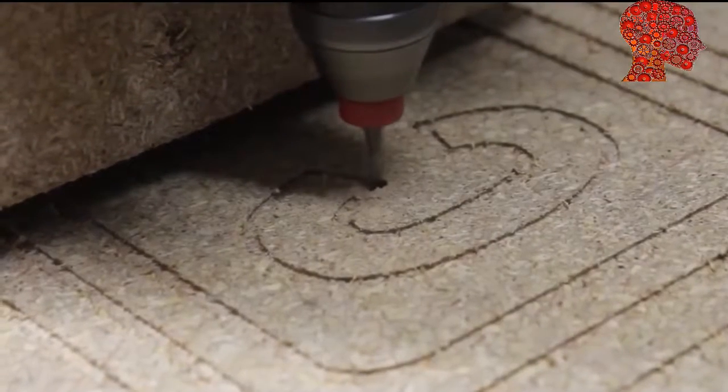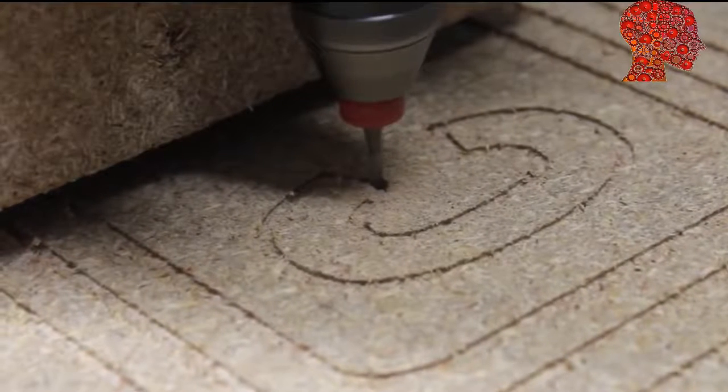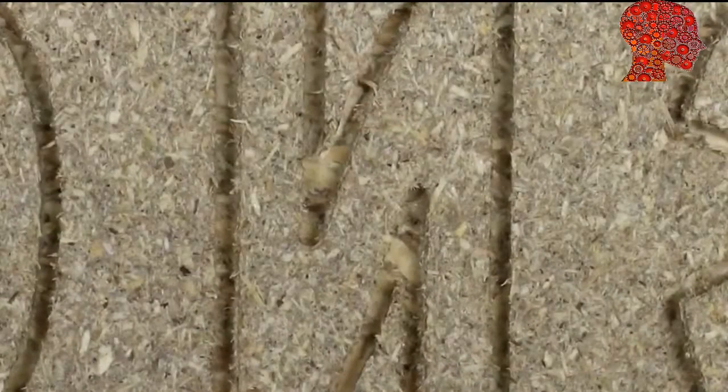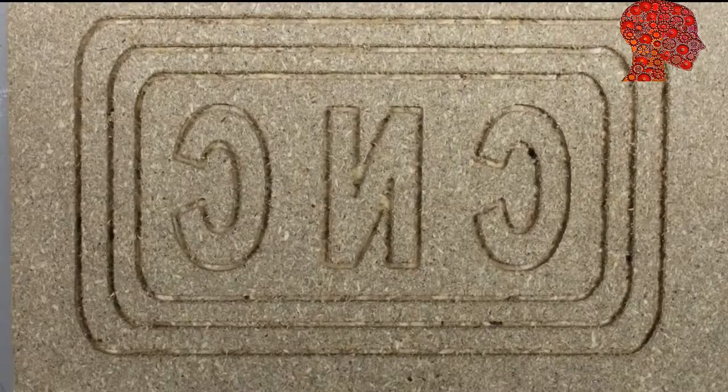You can lower the router for a second run. Leave all other parameters of the software unchanged. The paths are clearly visible now. The cutting edge isn't perfectly smooth, thus you can't engrave tiny structures with this machine. The characters shown here are approximately 5cm high.